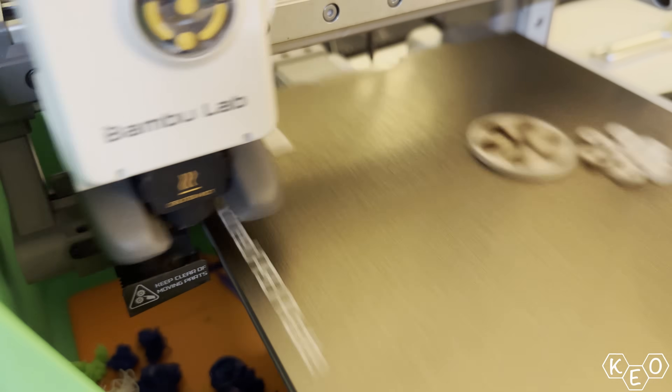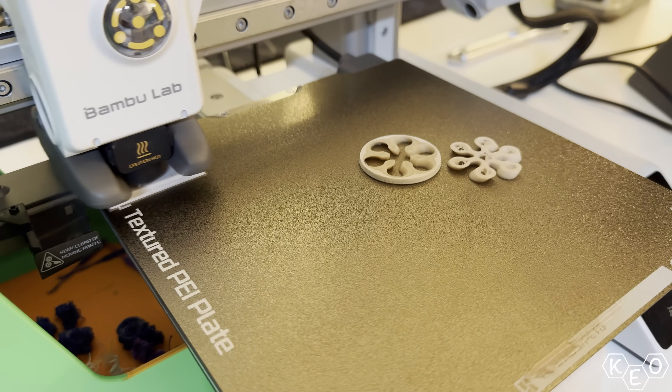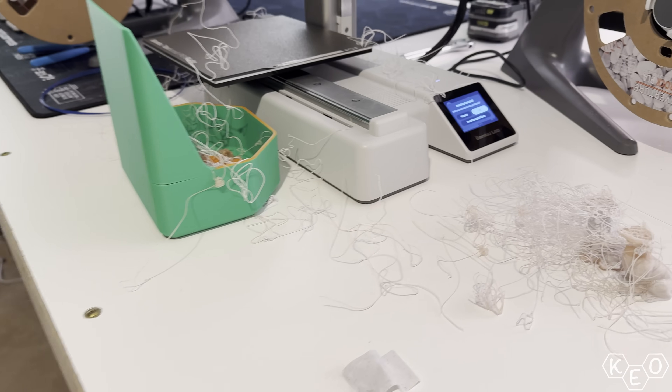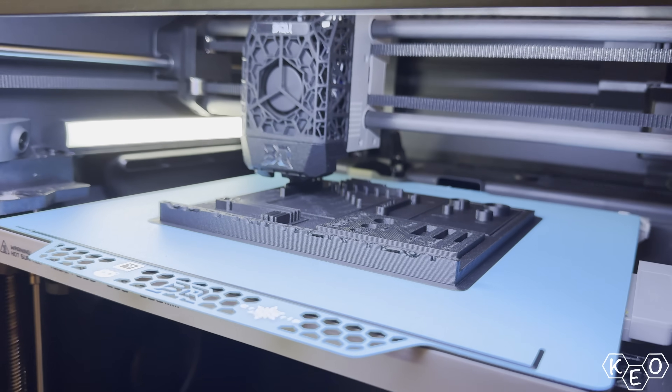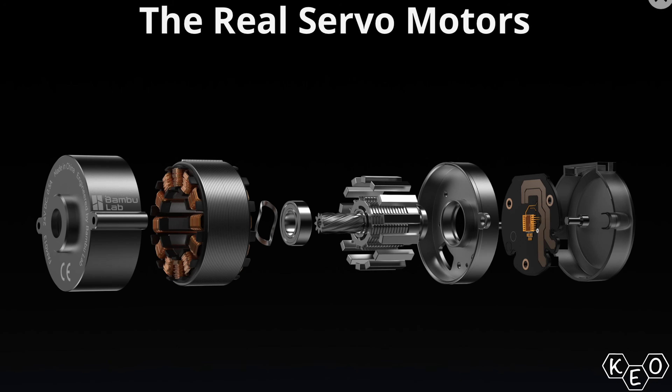What's closed-loop control and why do we care? Let's say your printer gets bumped during operation. A simple stepper motor is going to get jarred and lose track of where it's at, and your motor's not going to know how to get back to the model accurately because it's lost steps. Without going back to home to get a reference, your print's not going to do well. Now, a closed-loop motor — a servo motor or a servo stepper motor — is constantly gathering position data in real time. If the machine's bumped, the motor knows exactly how far off track it was moved, no need to home — it just compensates to get right back to the exact precise spot. There are plenty of machines that do closed-loop control already, but I haven't heard of any mainstream guys using proper servo motors.